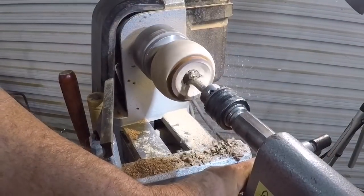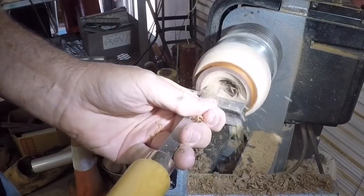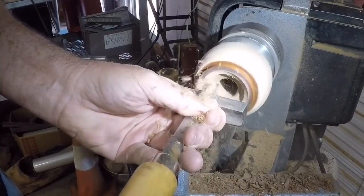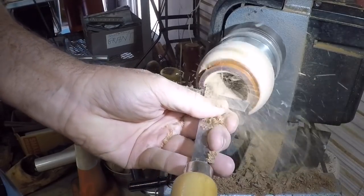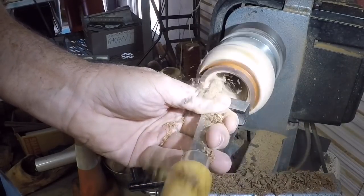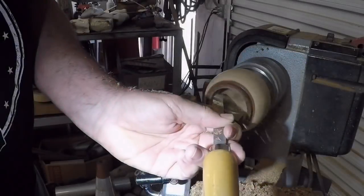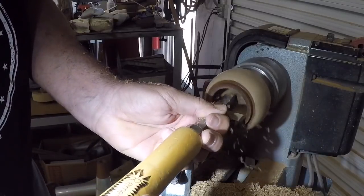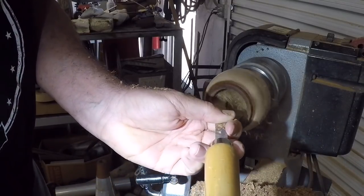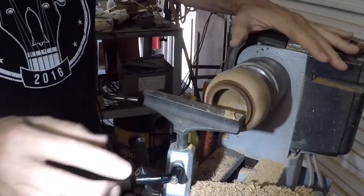I'm starting the coring with the one inch Forstner to get it going and then I switch over to a round nose scraper. That turned out to be a really good tool for this really dry mesquite — the insides came out pretty easily. I had to stop pretty regularly to check on the cracking and wormholes and do a little bit of stabilization along the way. But it probably took me less than 10 minutes to get this thing cored out. It was one of the easier core jobs that I've done.